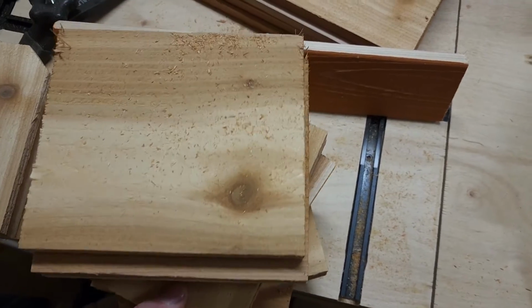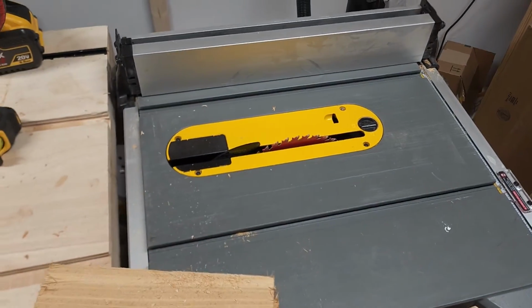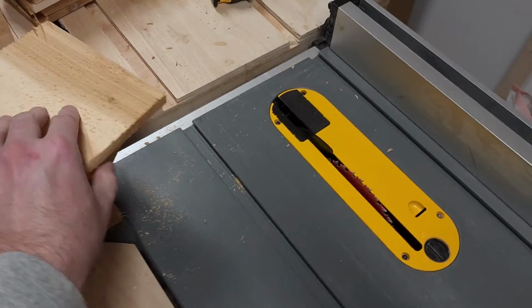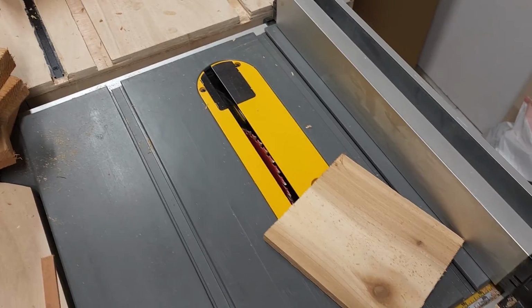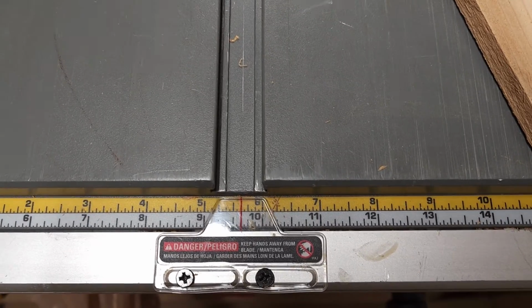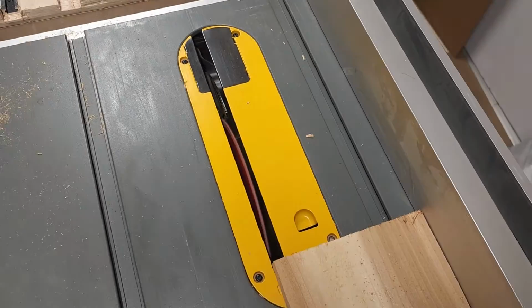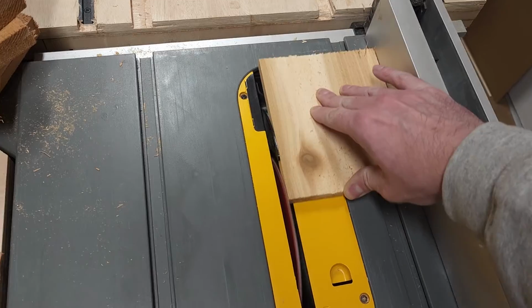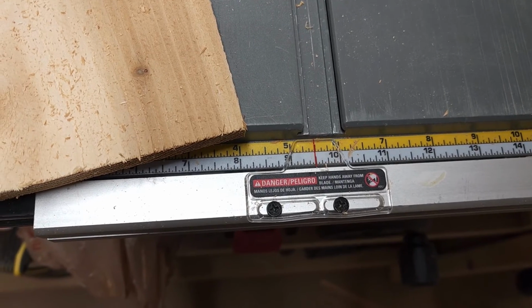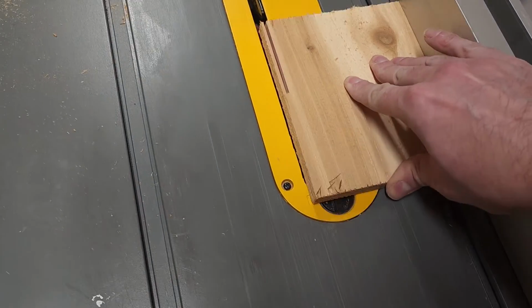And once you have that final measurement of your actual boxes, you could take your tops back to the saw to basically trim down your pieces to fit exactly the top of your box. So once I have the measurements of my boxes, as you can see, I am setting the fence to 5 3/4 to get to one side. So first pass is 5 3/4. Once I make all the cuts, I set it down to 5 1/2. And that's the actual short side final dimensions.